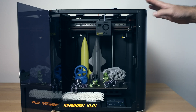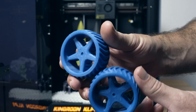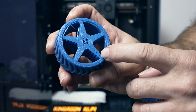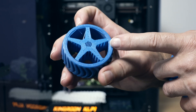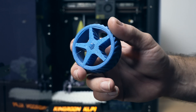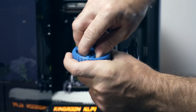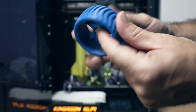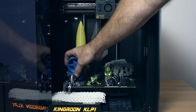Naturally I wanted to try a different type of filament — ABS — especially because we have an enclosure. We printed out these wheels, which came out pretty nicely overall. We do have a little bit of stringing and some layer separation on the very first layers, likely from filament shrinkage/contraction peeling off the bed. It appears we probably needed higher bed and nozzle temperature — I printed at 250 and 260 probably would have been better. The support broke off really clean with one twirl — quite a usable piece: little drift wheels for an RC car printed in ABS.